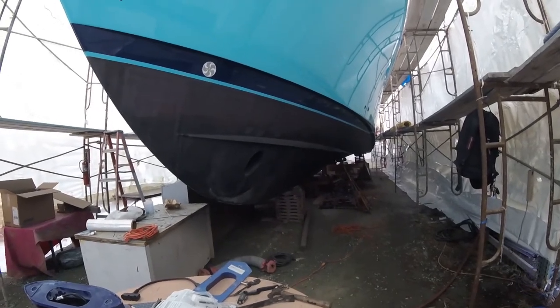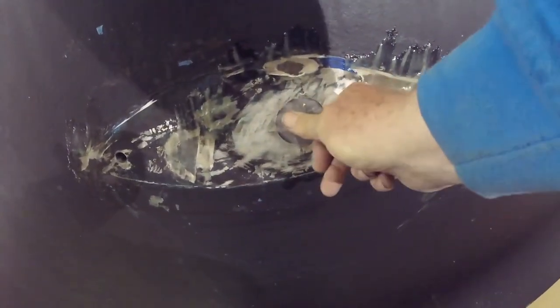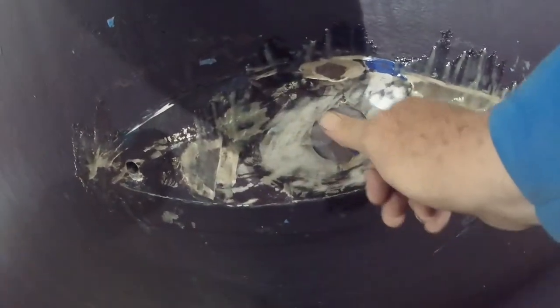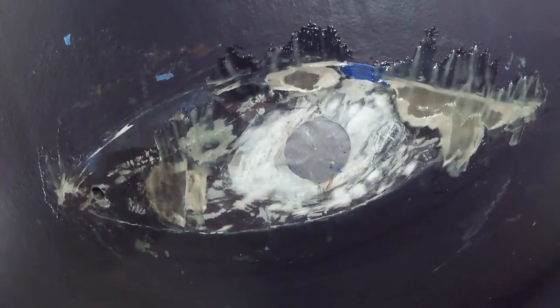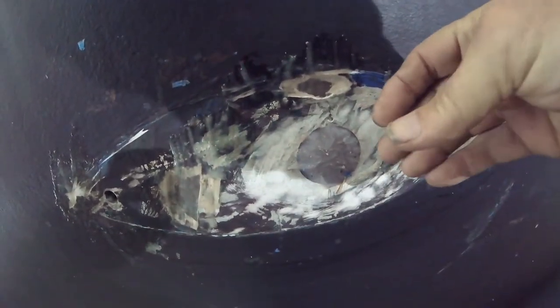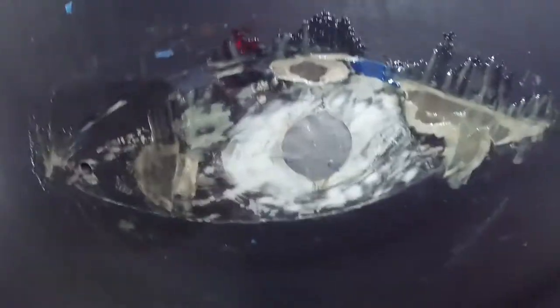Okay, we're back on the bottom here. We're pulling off this plastic we used to seal this. And you can see this, we filled this up with resin and mishmash and put in a slow amount of hardener. And we sealed this off and we filled it from the top. Now we know that we have solid fiberglass. So when we tighten up that compression nut and the through-hole nut, we know we're not trying to collapse the outer skin and the inner skin. Therefore, when it collapses, it becomes like an oval and then it could leak.